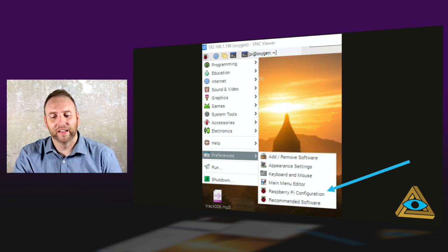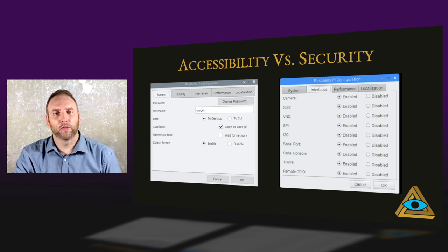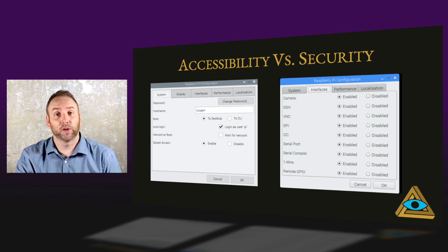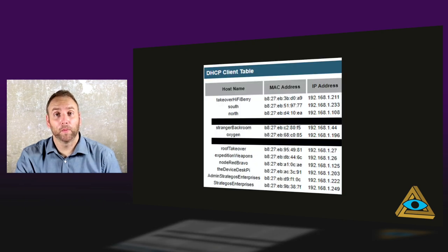After the initial setup, it'll set up your Wi-Fi and give you your updates. When it reboots, go to the top right to Raspberry > Preferences > Raspberry Pi Configuration. On all my Pis, all the passwords are the same and the username is the same. The only thing I change is the host name, naming it something like where the Pi is located or what puzzle it's operating. Then go to Interfaces and turn everything on. I only do this because all my Pis are on their own private router that doesn't connect to the internet — this is a huge security flaw, so if your Pi connects to the internet, look into securing it.